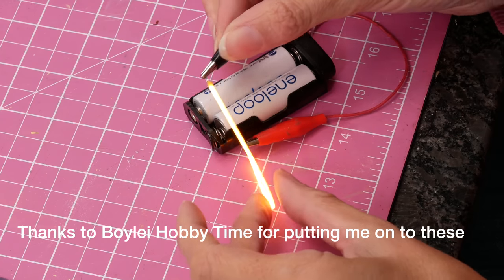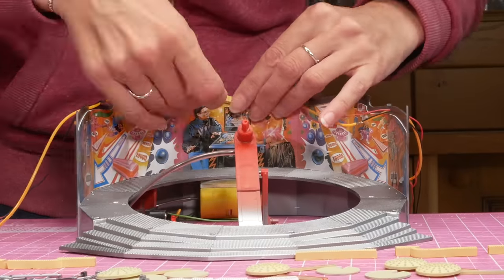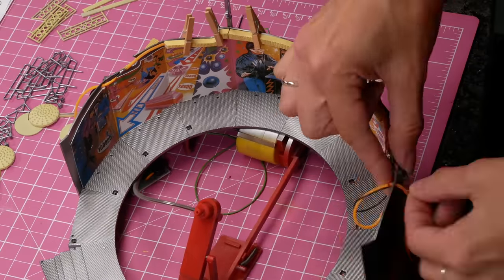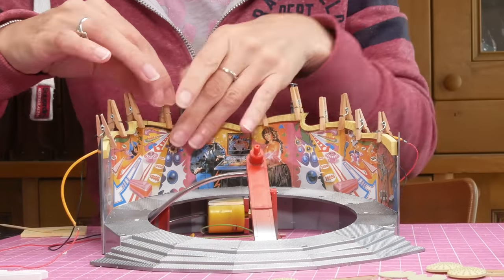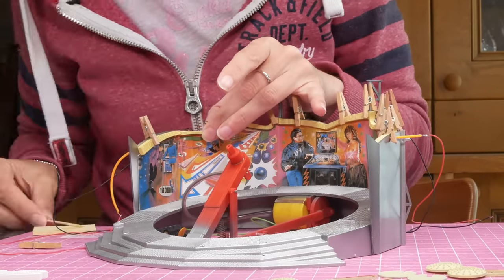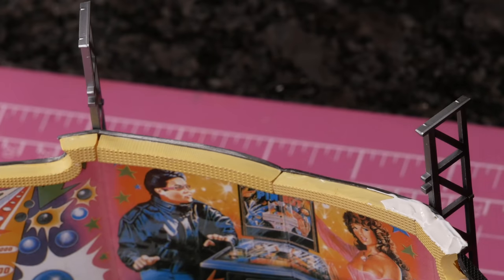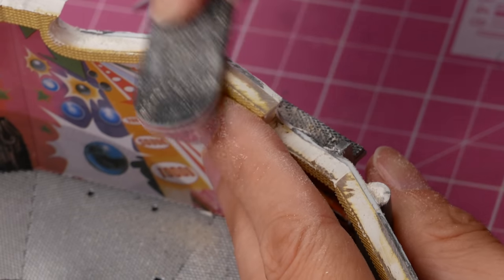So out came plan B. It's important to be flexible — and these are flexible LEDs. They're brilliant. I just had to sand a little bit out of one or two of the thinner pieces, slot them through, and I was done. It took a day, but that's basically what I did. Once I was sure everything fitted well — I know I've got some tails sticking out on the left and right — I super glued it all in place and just left those little mini clothes pegs to hold it. I filled the top with Vallejo putty to help with the light and any gaps, and left it to dry for 24 hours before sanding it all smooth.